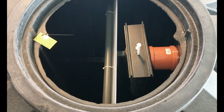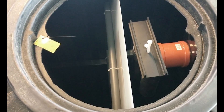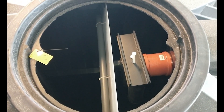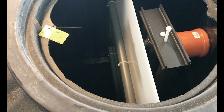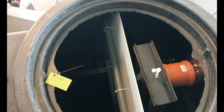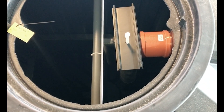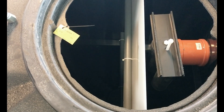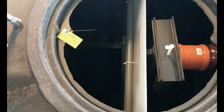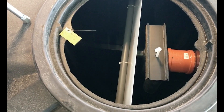Here you can see inside one of our pre-chamber tanks. This is a pre-chamber from our four-person system. Our complete four-person system includes this pre-chamber tank. Here is your sludge settlement, or your primary tank. And this part is your flow equalization or balancing chamber, balancing the peak flows. As you can see, the flow control device or throttle is fitted in place. Then the wastewater will continue to flow out of this tank into the biological reactor. If you have an existing septic tank, we will fit the flow control device within your existing septic tank.